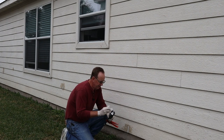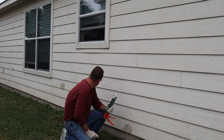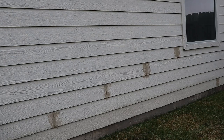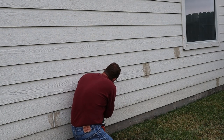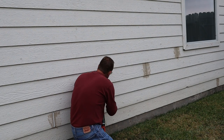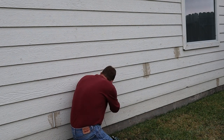It's water resistant. In case it rains, which it looks a little cloudy like it might, all I need is an hour and it can get rained on. If you were doing this for a living, you couldn't make any money taking as much time as I am at this. And I'm just lightly putting pressure on the caulking over the crack so that it doesn't cause a concaveness in the joint.